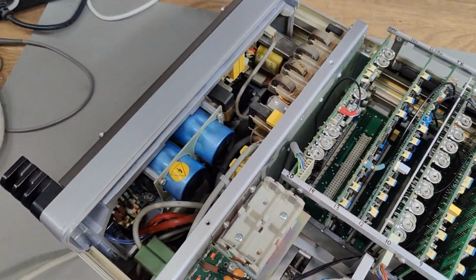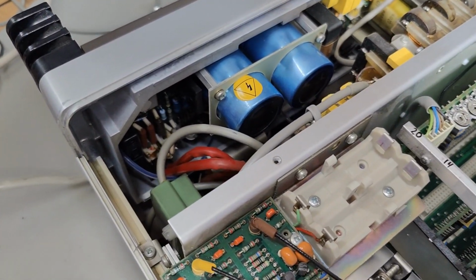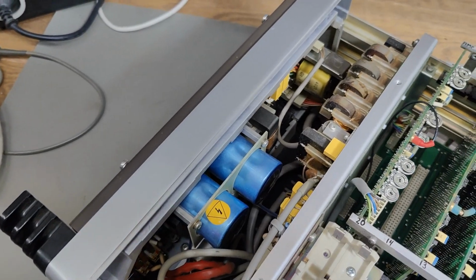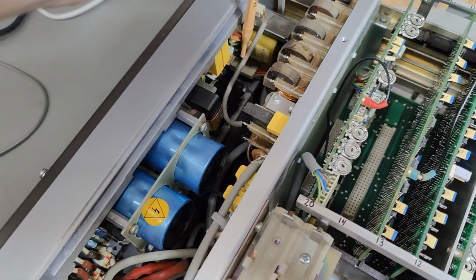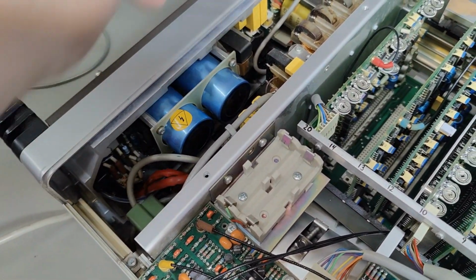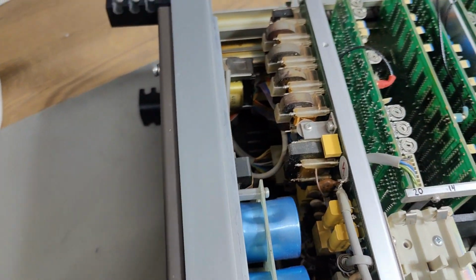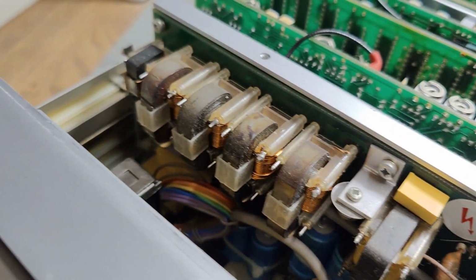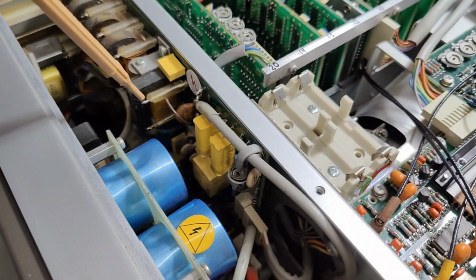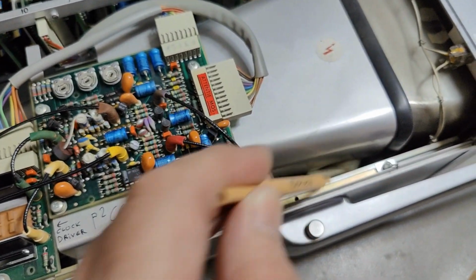And the power supply is already serviced in this module, so I don't really expect to talk so much about the power supply. There is already so much documentation about this power supply online, and yeah, there's a reservoir capacitor you need to service, and there is a main input filter that's always shorting. So those two things you definitely want to address first of all. We got some really nice filters right here for all the different DC rails, and the high voltage is coming out of this transformer that goes to the tripler, and that goes of course to the anode of the tube.